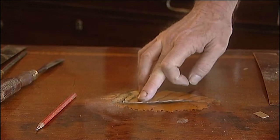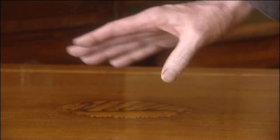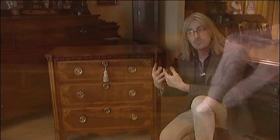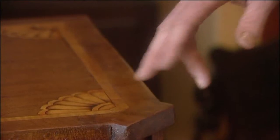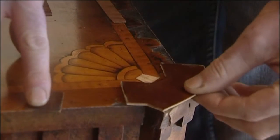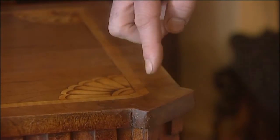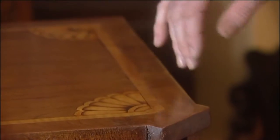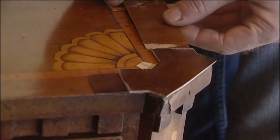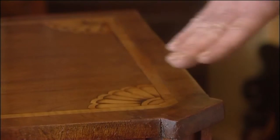It's nice to just put something back where it's missing and blend it in nicely. You can see slightly where the repair's been done, but it's aesthetically more pleasing. The colour is pretty well exactly the same as it was when we started, using old veneers and doing some light bleaching to keep that patination that we wanted. As you can see from the last pictures of this corner, there was quite a lot of damage — the satinwood was broken away, big lumps of veneer out, a moulding missing down the side. I replaced those with similar veneer from a similar period, which makes it look as untouched as possible.